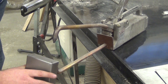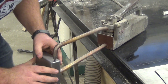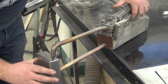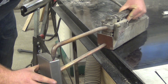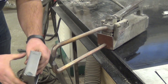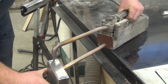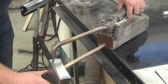When you do this, open up the jaw. You're going to set this in here. For this first assignment, you can get away with one spot weld. Get it in the middle of the tab, push down, and then pull the trigger. Then do the other ones — just rotate through. If you want to, you can do two, just don't do them right on top of each other.